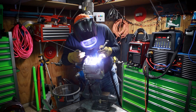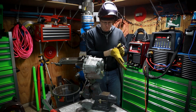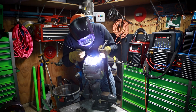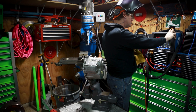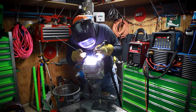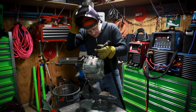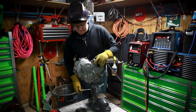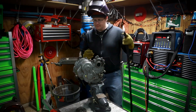What we're doing here is we're TIGging around the perimeter of the area that I wanted to build up. I really wanted to start off with TIG on this just because I didn't know how well the casting was going to weld, so I just kind of wanted to take it slow and not potentially destroy it. Midway through I had to adjust the settings on my Dynasty — changed the frequency from around 120 hertz down to about 80 hertz just to let the puddle flow out and soak into the casting.